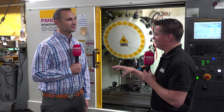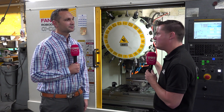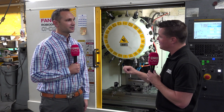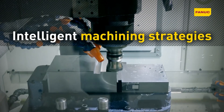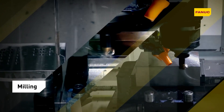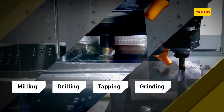Let's talk about the finishes, because you've shown me some pieces that are gorgeous — I could see my face in it, it was shining so much. Do you find that the tolerances, accuracy, and precision all come along with that speed as well? Oh, absolutely. With those light cuts, you take a smaller pick so you get that better finish, really nice shine to it afterwards. And the tool life lasts a lot longer. So it's really working out.